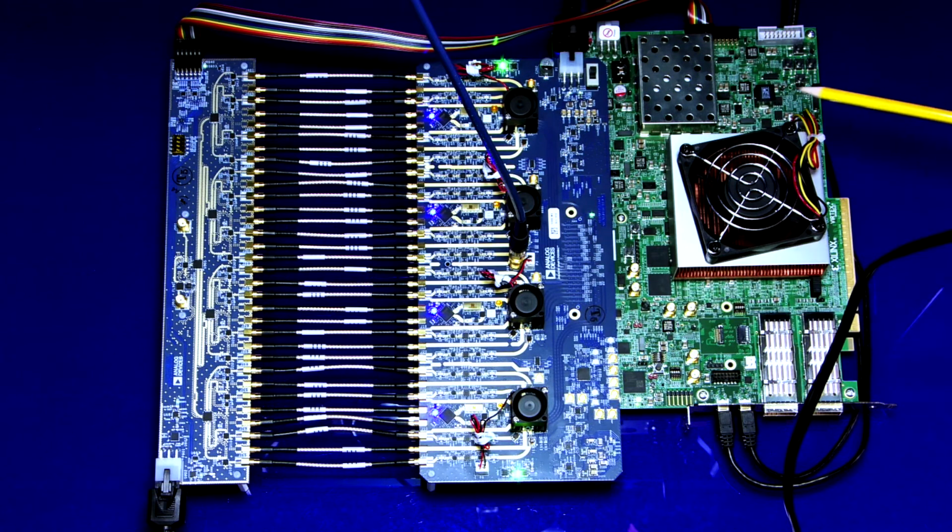In order to interface to the Quad MxFE board, an Ethernet cable and 2 USB cables must be connected to the VCU118. These allow for programming of the FPGA and configuration of the Quad MxFE. In this setup, the Ethernet cable connects to the laptop via a USB to Ethernet dongle. Do not use the Ethernet cable from the VCU118 kit, as this is a crossover cable and will not work.